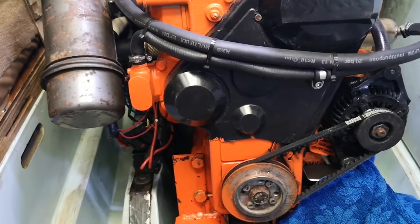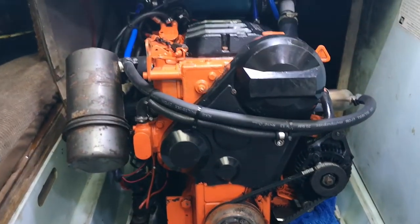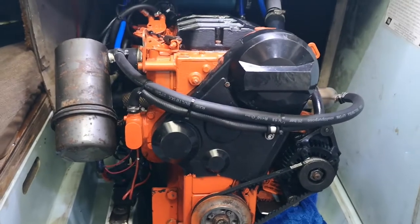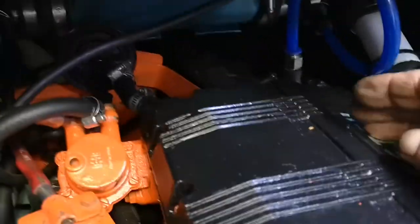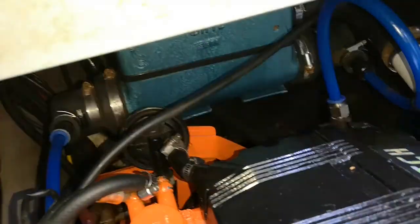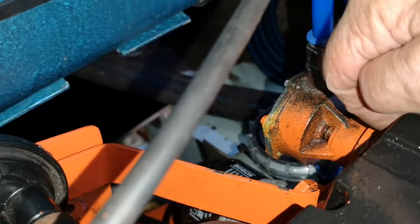I may have identified a pending problem. This engine was obviously designed to go in a John Deere gang mower tractor. It's brand new — a Lombardini — and they do fit them in boats, but it wasn't marinized, so I had to marinize it myself. I put in a Bowman heat exchanger, so it has fresh water circulating through the engine through the heat exchanger. We have a seawater pump that runs off the camshaft, which goes across the top of the engine. Here's the seawater pump — it joins into the engine back here. There's no belt; it's mechanically driven. I made a little dog that joins this to the camshaft.